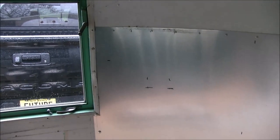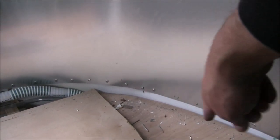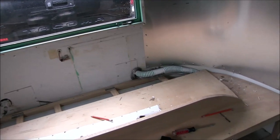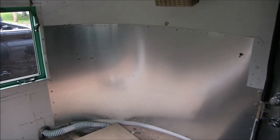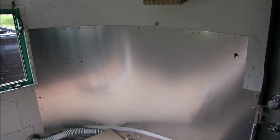So after about 30 minutes of drilling and riveting, I got the new panel installed. It slips behind the seam like I wanted to, right up to the door frame and gasket. Along the bottom there was a little bit of warping on the panel behind it, so I pulled it in with screws. Once I get the interior furniture I have mocked up in here, I'm going to take it out and sand and stain it. Then when I get to the painting process I'll put those last few rivets in. As I got to the bottom I had to use bigger rivets than what I used up top, and I really needed to pull that in. The top is going to match the rivets that the rest of the shell has. Well, this is Patrick with New Jersey's Outdoor Adventures YouTube channel — I hope you enjoyed this video. Please like, share, subscribe. We'll see you soon.